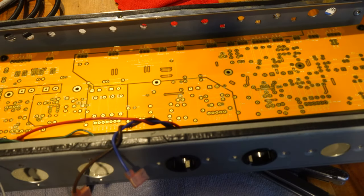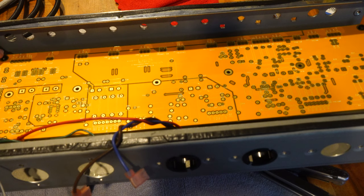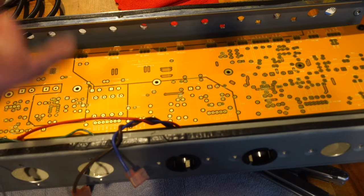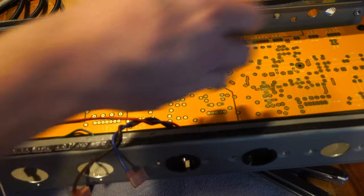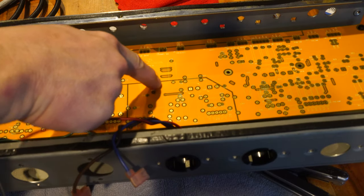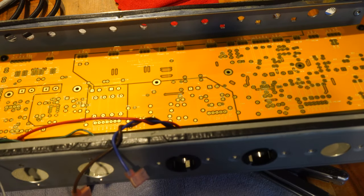It sort of worked, but I also did a boneheaded move — I even wrote a T on my piece of paper for the top, and then I think I inverted it. The four corners worked fine because they're in a rectangular shape, but the middle holes are shifted — this half is down, this is up — it went the other way around. My center tube holes are nowhere near where they're supposed to be. There's definitely some flex, but with the rigidity of this board just sitting inside I'm not sure how much of a big deal it is. I also found I couldn't use one hole because it's right over the output transformer, so I'll re-drill a couple.